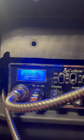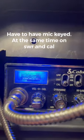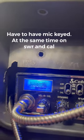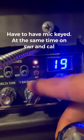...perfect. That's where you want it. But to calibrate it, you push this down — see how it goes all the way to the arrow. Calibrate. You move the calibration right here with this one — SWR — and you put it on the arrow.